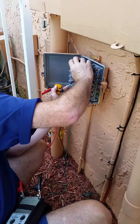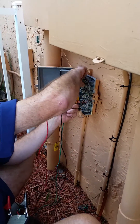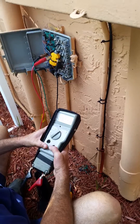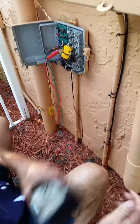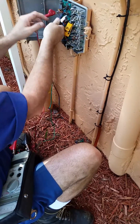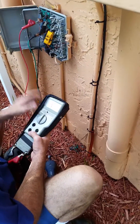This is 8729, and it's on the white-green/white-blue — on a white-blue of a separate IDA. Let's see what this one is doing. No voltage — this one's clean. I don't even know that this is going anywhere; it might not even be used. Let me see if this one even has dial tone on it — it may just be a leftover.